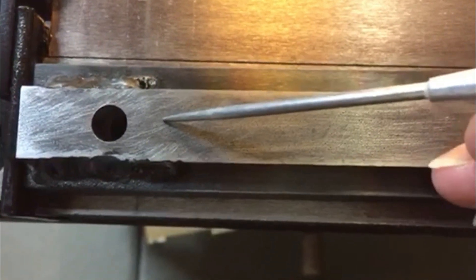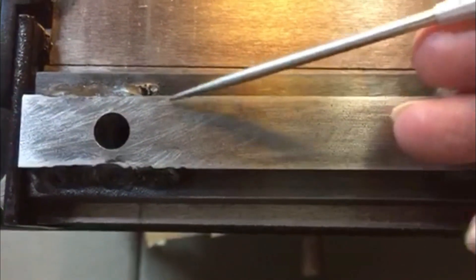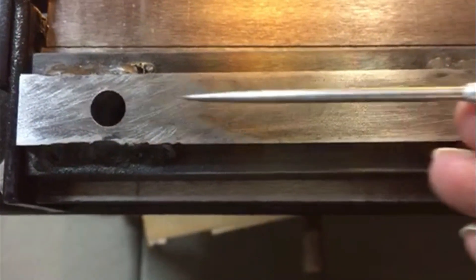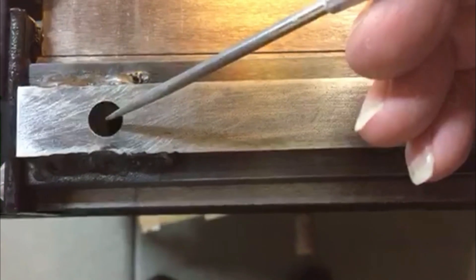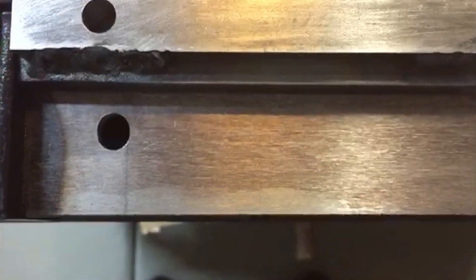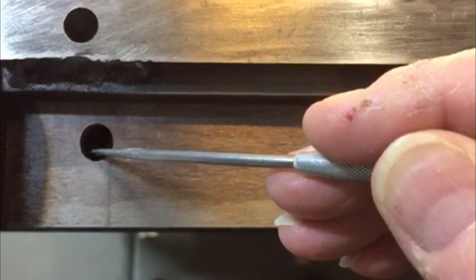The next piece I want to show you is the press plate. I went ahead and welded on a piece of steel which is three-quarter-inch wide by one-quarter-inch tall. I'm not going to put the other piece on — it's just too much — but that's good backing, it'll help strengthen the whole press plate. I went ahead and stitch-welded it 10 times, and also put a handle on it. Some people put springs on the end so they can just lift it up. I also drilled at each end a three-eighths hole, and on the base this has been elongated, and I'll show you why.